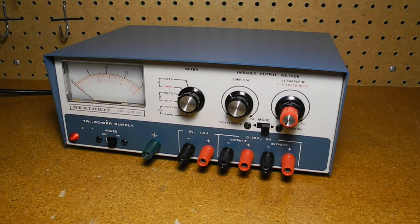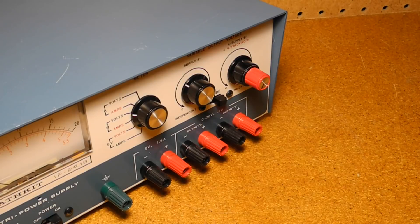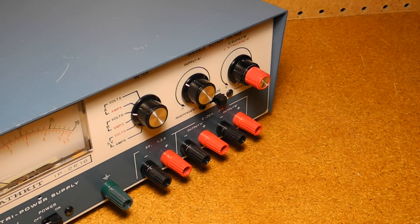I bought this unit in January of 2019 from a Kijiji seller in Ottawa, Canada. He demonstrated that it was working and said he had built it about 30 years ago but didn't really use it. It was complete but without a manual. Taking it home, I found the unit was assembled well and very clean inside, and confirmed it was working. I found several incomplete manuals on the internet as PDF downloads. The manual is of the usual excellent Heathkit quality with detailed assembly instructions, test and calibration steps, theory of operation and troubleshooting, and a schematic with voltages listed. The previous owner had intentionally locked the A output at 5 volts — the supply A knob would not turn. I think he used super glue or maybe Loctite on the control potentiometer. I was able to loosen it by heating it with a heat gun, making it variable again.